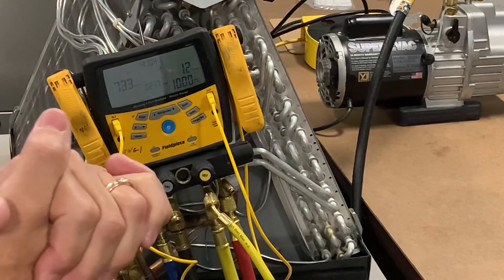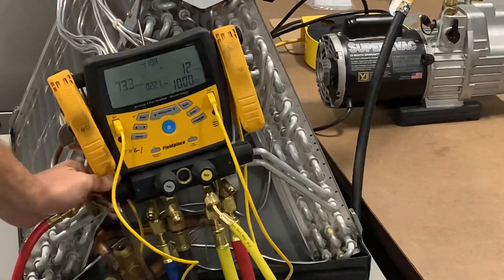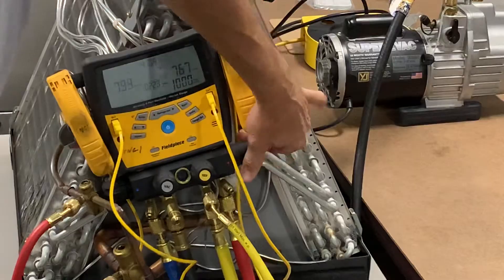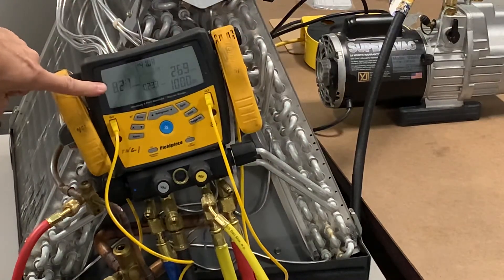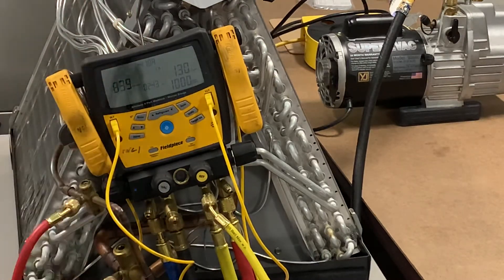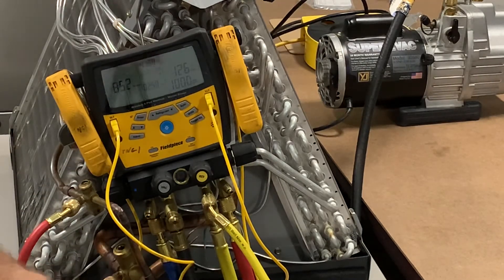So don't shut off the left and right. I'm going to open these up just to see what my coil is. The moment I open these up, you can see it raising. This is actually reading my line set and my evaporator. You can tell I was not down to 500 inside, but more importantly, we want to check the inside and watch its microns to determine if there are non-condensibles or a leak in the system, by checking whether it holds its microns down.